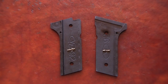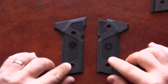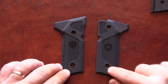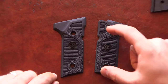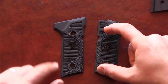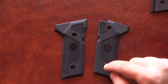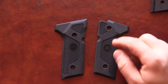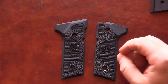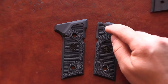I'll flip them over later so you can see the result. The reason why I decided to modify these is because I got these original Beretta 92 Vertec grips from Beretta. These are plastic grips and as I found out, the Vertec frames were slightly different from the Beretta 92FS frames — on the Vertec, the grip screws are positioned a little bit closer together than on the 92FS. So when I got these grips I had to modify them to fit, which involved dremeling out the screw head holes and the bushing holes inside so the grips could sit on the frame properly. What that created was a small gap on the outside edges between the grip screw head and the hole in the grip.